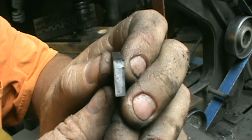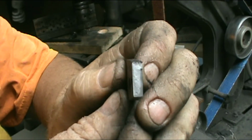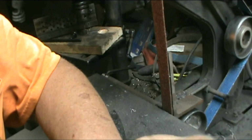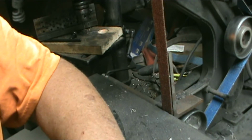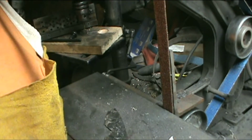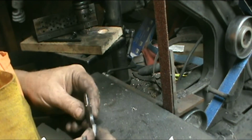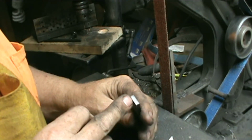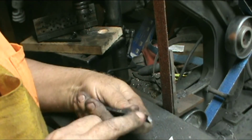This right here is the grain structure on this knife. You talk about tiny, tiny, tiny little grains in there. Yep. It's like an 800 grit sandpaper. Now, if it looked like a 60 grit, I'd say it was done. It wasn't done right. But this was done. It converted real good. No, it was cracked. And when I dropped it, it just came on apart.